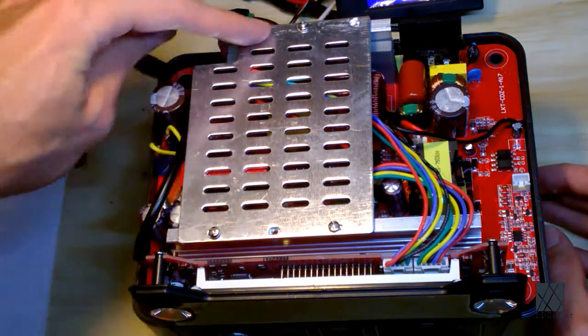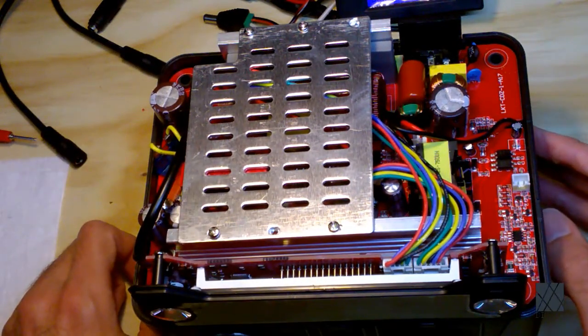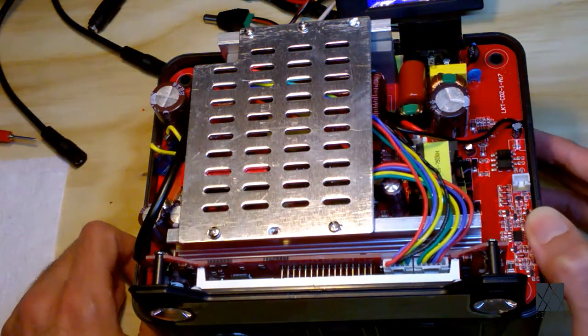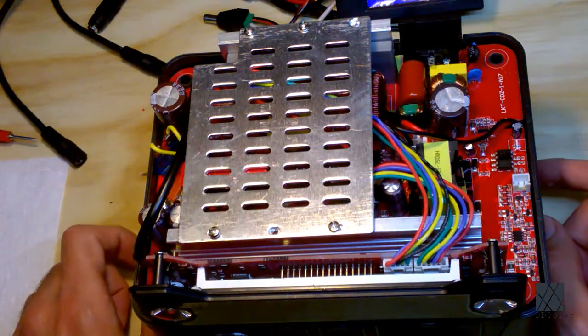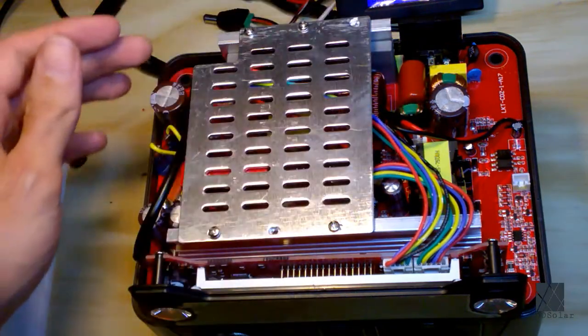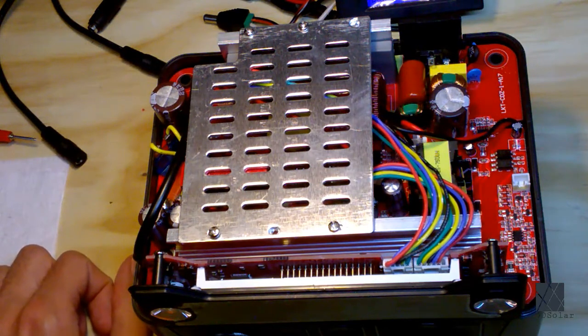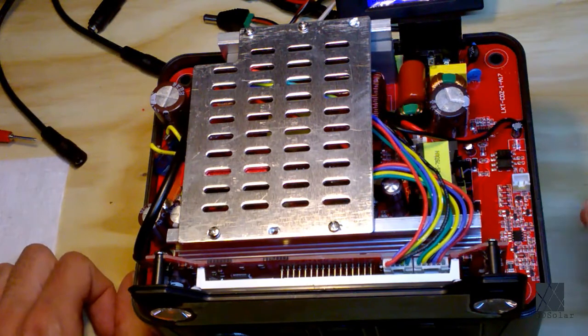Now there's no heat sink compound here, but you could put that there. I like modifying and tweaking things like this. Now, I don't remember which way the fans blow by default. Generally, I've heard you want the air blowing in because that generates turbulence and leads to better cooling. If you have air blowing out, you're drawing air in and it creates a laminar flow, for example, around these capacitors, and you get hot spots. Now, of course, that's really being nitpicky, but if you're into that sort of thing, I generally reverse my fans to blow in, unless there's a reason to have them blowing out.